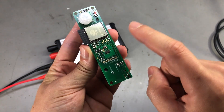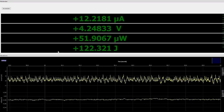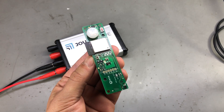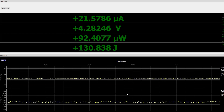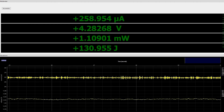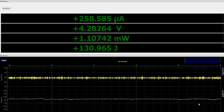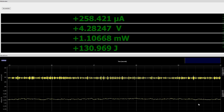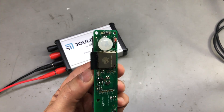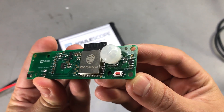You might also be interested in how much power the different sections use. The ESP32 draws 12 microamps in deep sleep. With the temperature/humidity sensor connected but idle, it adds only a few hundred nanoamps — certainly negligible. Connecting the PIR sensor adds another 9–10 microamps while idle, which is not bad. However, the RGB LED when idle adds a whopping 236 microamps to the total. So it may be worth adding a MOSFET to cut power to the LED during sleep, or simply not populating the RGB LED at all. In my case I'll leave its jumper disconnected, giving a total sleep current of about 21–22 microamps.